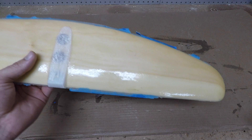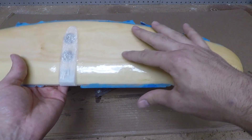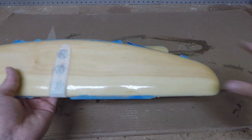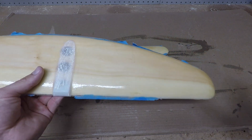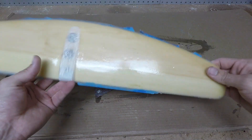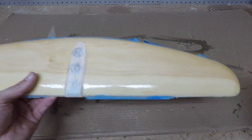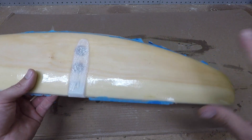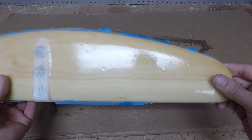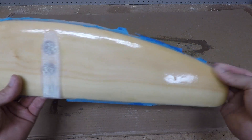I'm happy with how the final coat came out - that's why I'm now not using gloves and just grabbing these with my hands. If you want to redo it, give it another coat to make things smoother - just keep your gloves on, sand everything smooth, and brush another coat on. You can really keep doing that until it's like mirror smooth. But once I sand this down and paint it, it's going to look great.